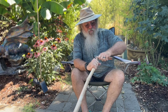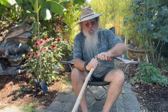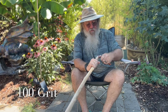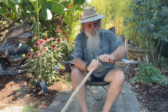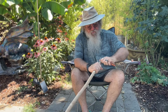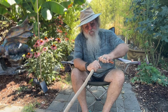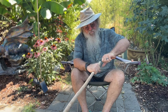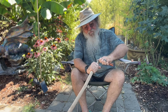This stick is sanded. It's first sanding. And that's about 100, 120. I can't remember for sure. And then I will go back over it with 220 on the second sanding. And then I will stain it. Now before I give it the second sanding, we're also going to put lanyard holes in these, so that it can sand those up nice and neat. Because I haven't got me the proper bit yet. All in due time. No sense buying everything at once, and you won't have nothing to worry about, right?